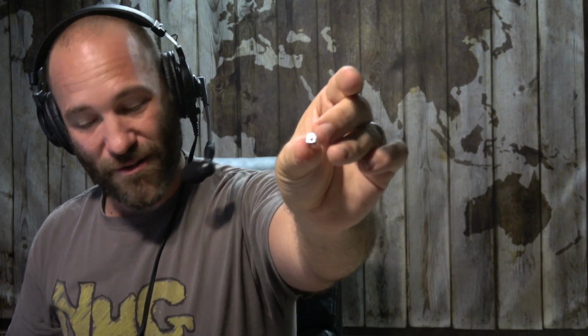Beyond that, it shows you how to use little buttons in order to create physical actions. It has a little piezo to produce little audio sounds. I really do have to say, this temperature sensor, this little 25-cent thing, is probably the most valuable thing in the kit. If the temperature goes above a certain level, you could have your Arduino start emitting an audible sound so that you know the server room is now above 90 degrees. You could have an LED go off, and you could have the little audio alarm go off. That can be a valuable thing.